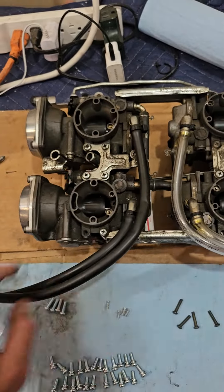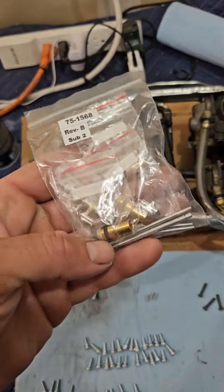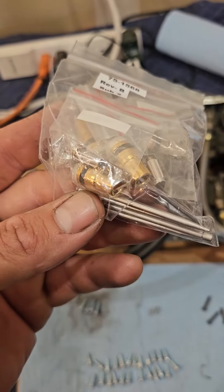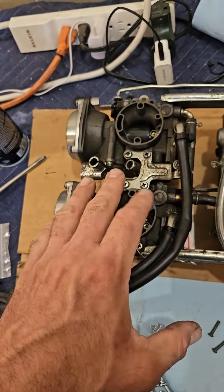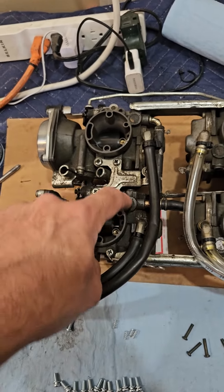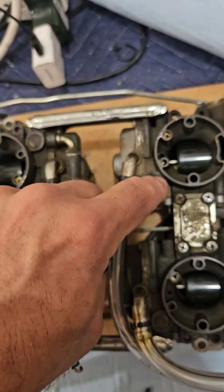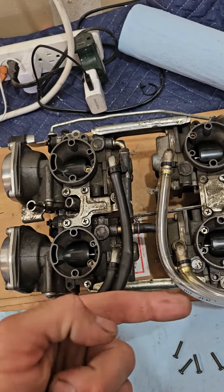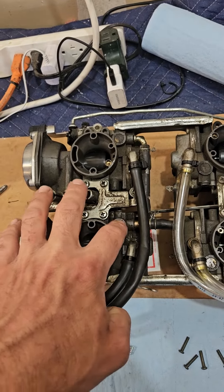Whenever I'm doing it, a lot of people don't use these — I can't speak for everybody, just from what I've seen. It comes with new needle seats. If you've ever taken one of these apart, and I'll show it to you when I get it apart — I'll make another video — the needle seats are inserted through the top of these plugs. See these plugs? That's the other side of those where the needle seats are. You push them through that way. They don't come out from the inside. You have to push them out that way, which means you have to remove these plugs.